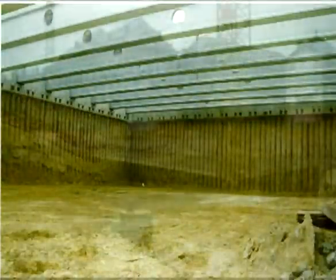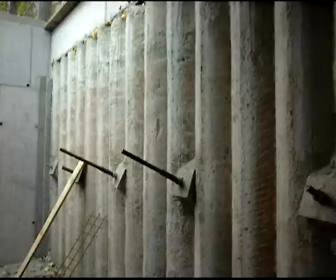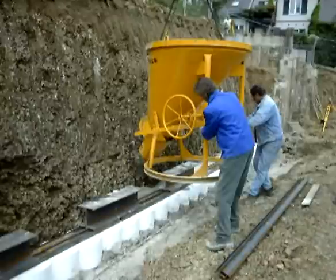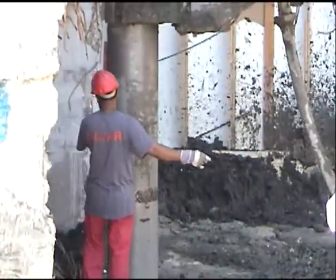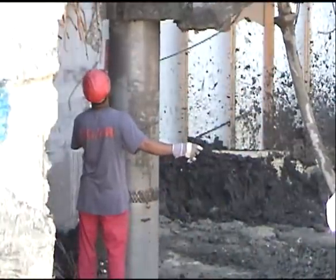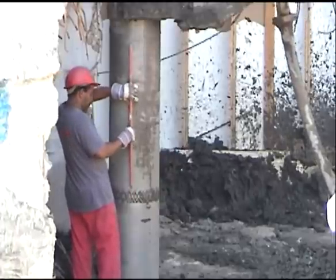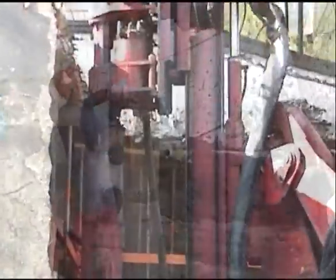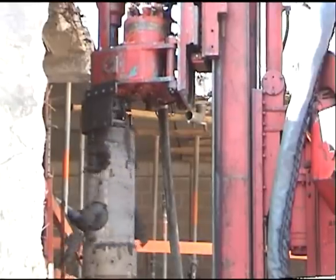The examples we are going to look at are load-bearing secant walls. To create a secant wall, precise positioning and alignment are crucial. The precise positioning of each pile is achieved by drilling through a styrofoam template that suits the diameter of the casing used. Alignment is then maintained by using the mast adjustment and self-leveling features. The counter-rotating directions of auger and casing also help prevent deviation of the hole.